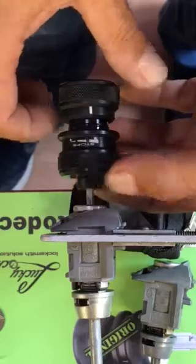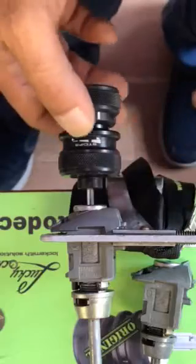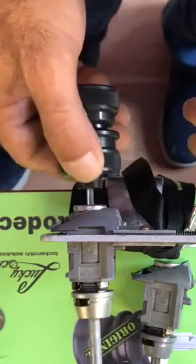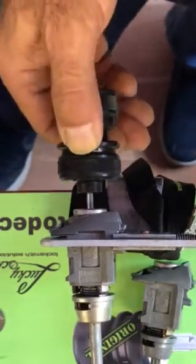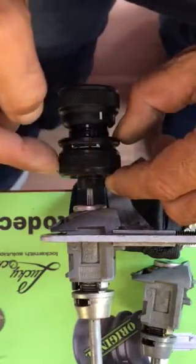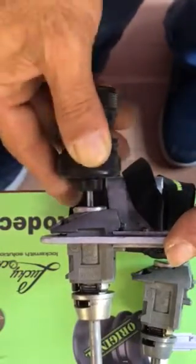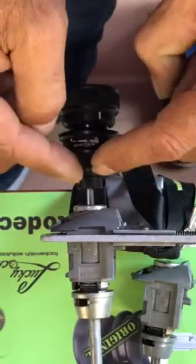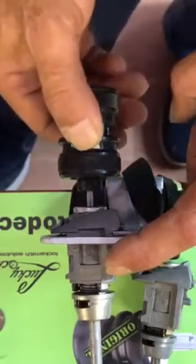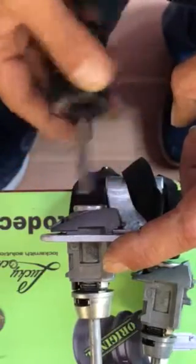the procedure to extract the tool, you have to turn the back wheel completely to the right and stay in neutral lock position, not turn it neutral, and push forward this middle wheel. When it goes into the tension wheel only, now you can extract the tool. There is no other way to extract it. If you forget to push this forward, the tool will remain in the lock and you cannot extract it. Just click like that. That must be all the way to the right and you can extract.